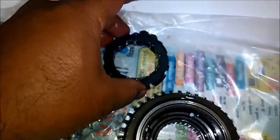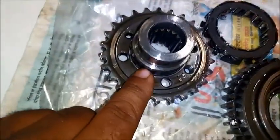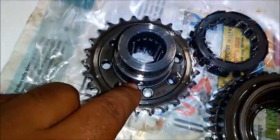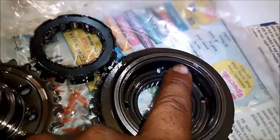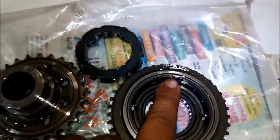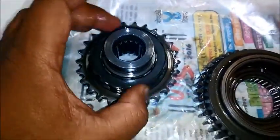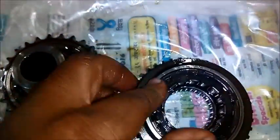Changing only one part is not advisable because we do not know which spare has exactly failed among the three. There is a possibility that a face is worn — but unless you have the database or tolerances from the company, you cannot measure and confirm the exact dimension. Similarly, the second face may also be damaged. Without proper database and tolerance specifications for the Sprag Clutch, it is better to change the whole unit.